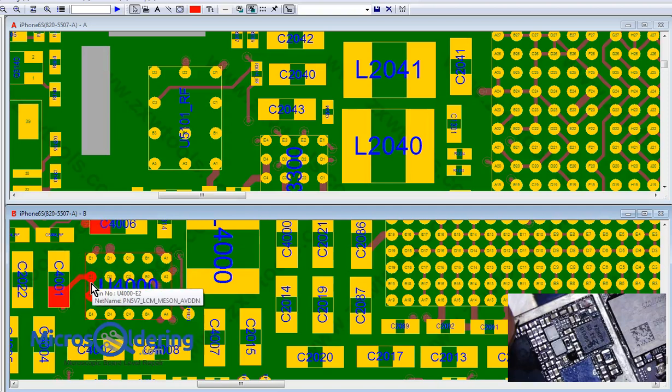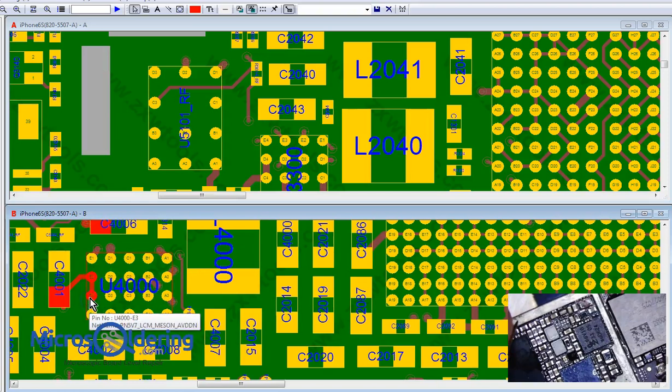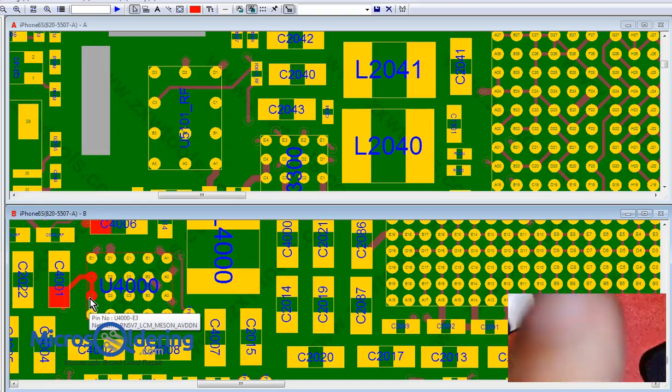And then, okay, so this side, we should definitely get a reading on that one. And let's check these two. This is OL. Actually, hold on. Is this supposed to be? Actually, the chip provides the power, so this is the output. So I think they are supposed to be OL unless the chip's on. Okay, so that's fine. You know what? Before we even do this, let's reboot. Let's plug it in and see what happens.